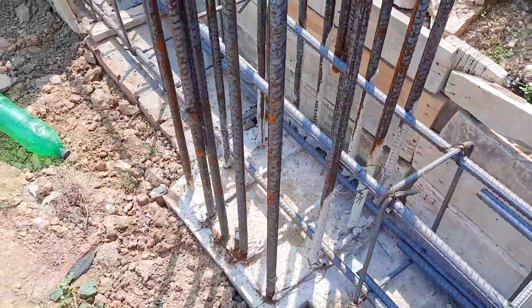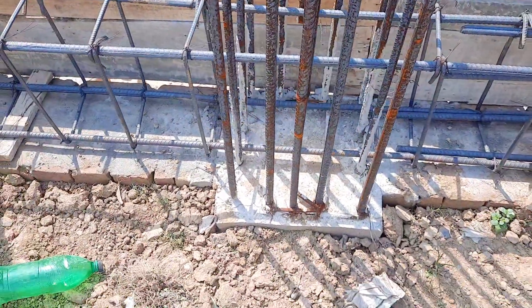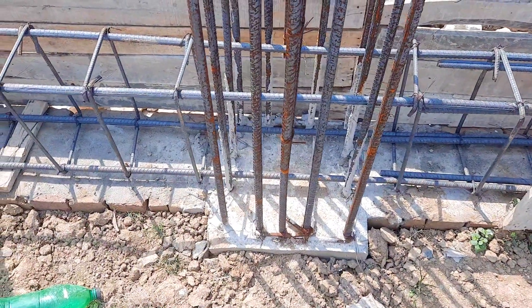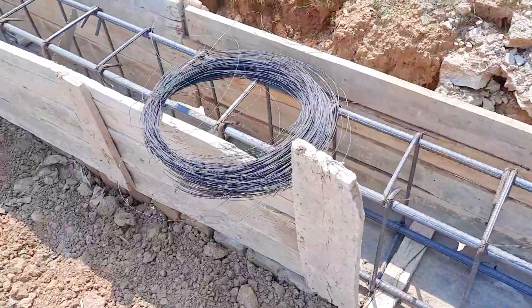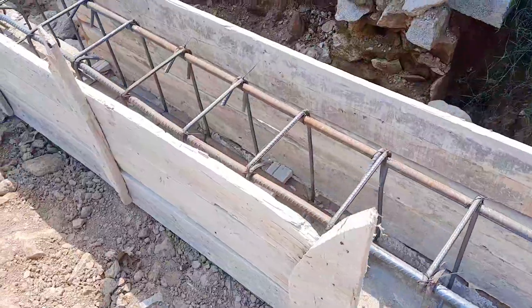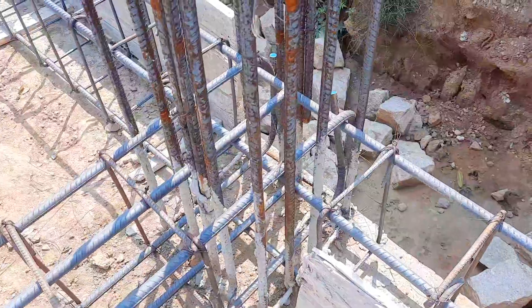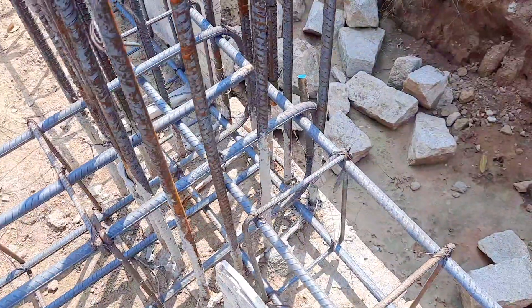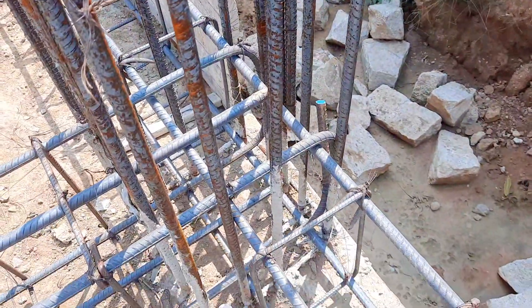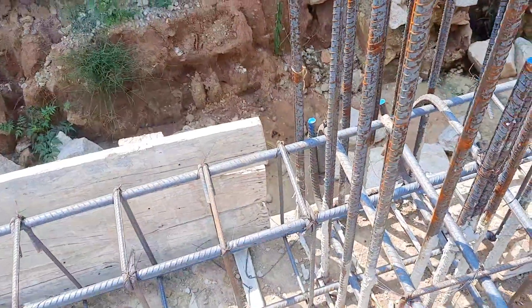The column size here is 15 by 15 inches at ground level. They used 12 numbers of steel rods of 16mm diameter, and spacing up to a maximum of 16 feet. They provided development length here, which is one of the best design decisions at this place, because development length is very important to make a good bond between steel and concrete. The length is about seven to eight inches, which is great.